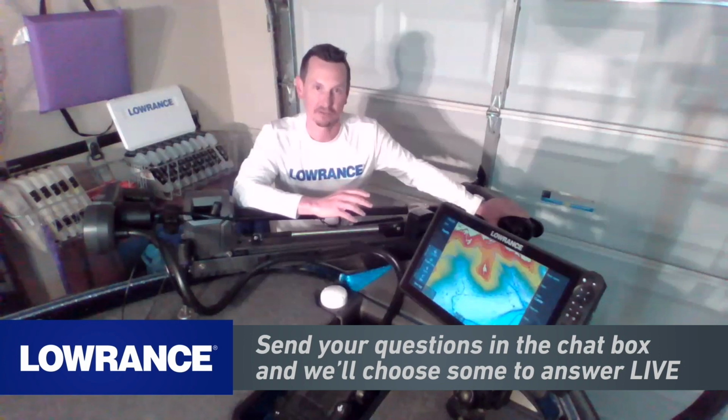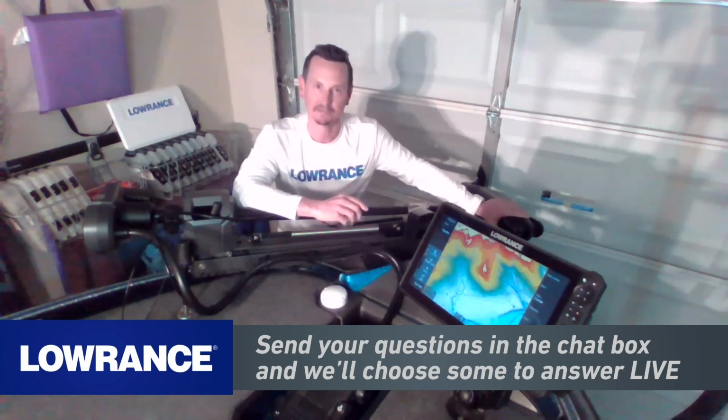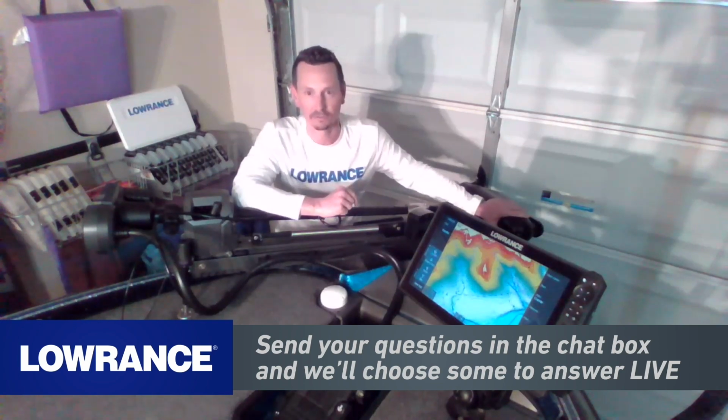And all of those same things you see in the brushless cordless drill market translate directly into trolling motors. But the one other added benefit you get is that you don't have those brushes arcing around your transducer, so you don't get any sonar interference. That's a big deal because as we've moved to more vertical fishing and tracking jigs and baits, being able to get crystal clear returns and see your baits and targets is really important.